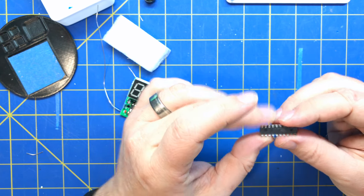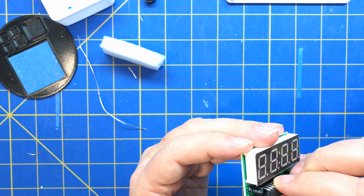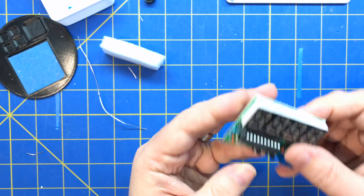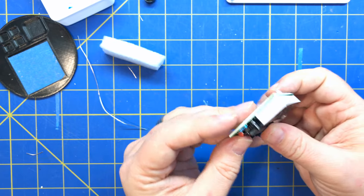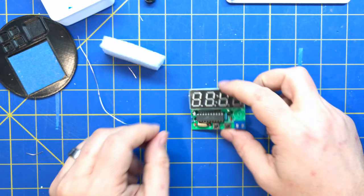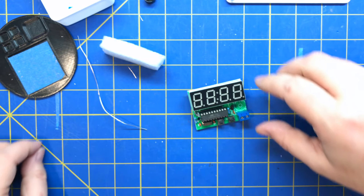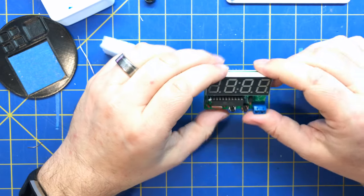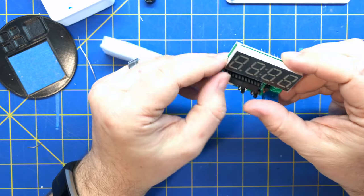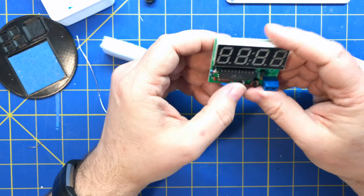really get a feel for how gentle you need to be when you bend them. It takes practice, but you should be able to just do multiple reps. Bend it as little as possible and just do it a couple times. Don't try to bend it once, because it will completely bend and screw up your pins.